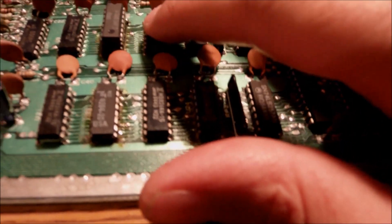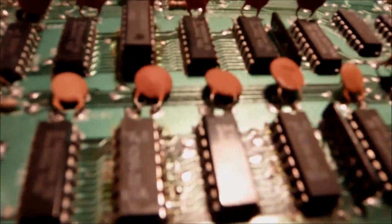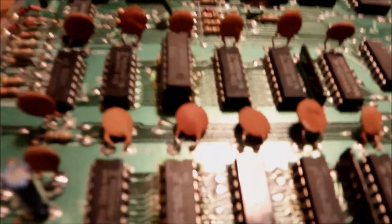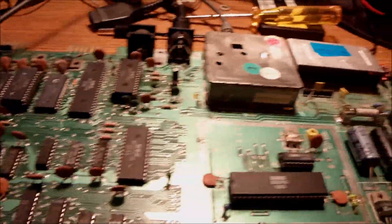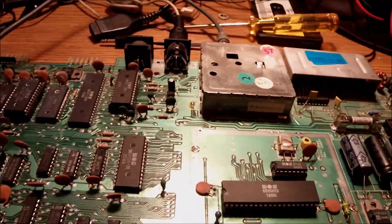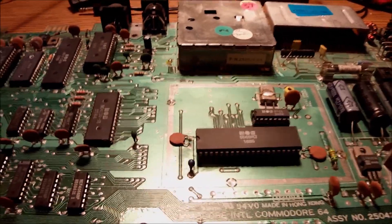The failing chip is U10. The reason I picked U10 first is that the matrix table indicated U11, so I went one position before that. What I usually do is check U11 as well, and then the very next one.